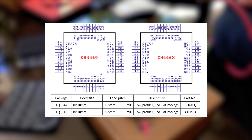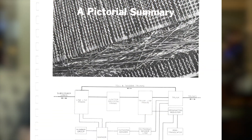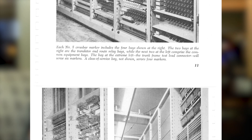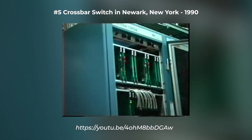This uses CH446Q analog crosspoint switches. It basically works like a telephone network. A lot of the theory for this comes from 1960s Bell Labs papers about how to route phone calls through a telephone network. Originally it was literally a grid of crossed bars — if you wanted to make a connection, you would clip this bar to that bar, and that's where the word crossbar switch comes from. Now they have them in silicon.